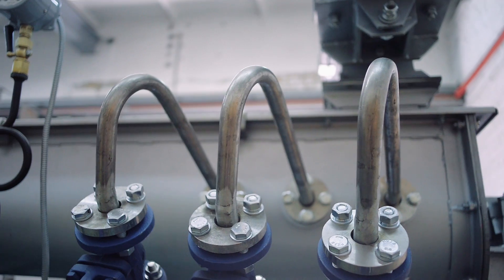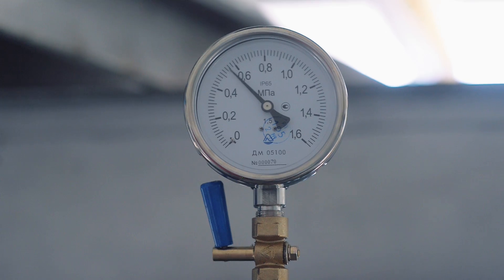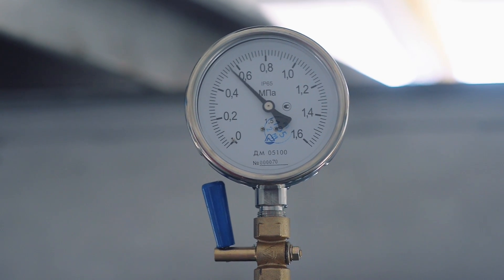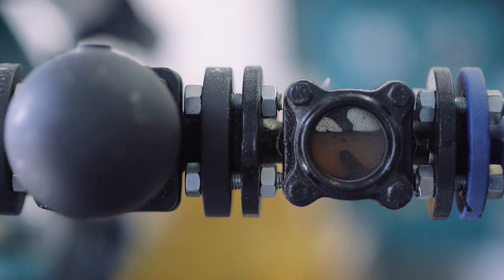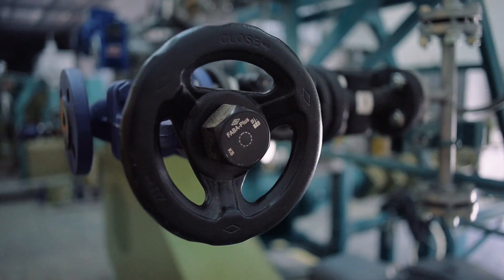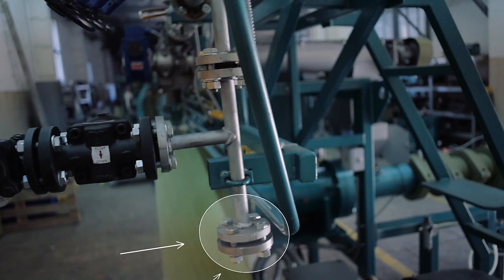The steam supply goes directly into the preconditioner. On the side of the high steam pressure feed, an electric contact pressure gauge is mounted. On the side of the low steam pressure feed, a pressure gauge is mounted. A condensate catcher, inspection glass and cut-off valve are installed on part of the condensate drain trap. Sludge from the water separator and collector is drained through the vertical pipes with these plugs.